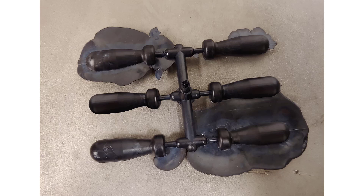In the end we have an overfill, which results in flash around the parts. Flash is the extra material that crept into the mating surfaces of the mold. There are some usable parts, but again not all of them are usable. This can be due to many factors such as barrel and nozzle temperature, mold temperature, injection time, injection pressure, and/or the cycle time.